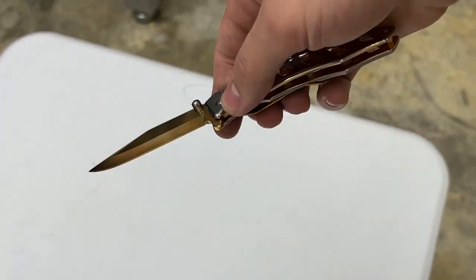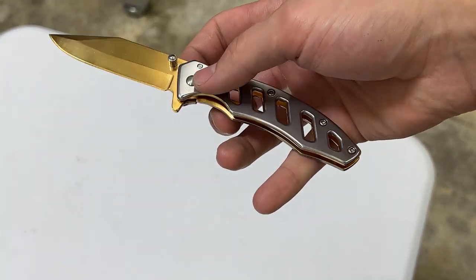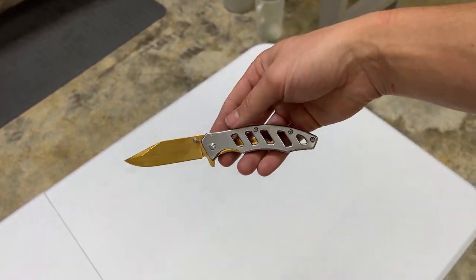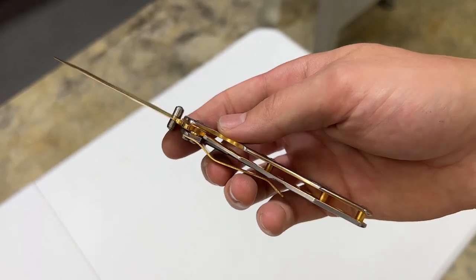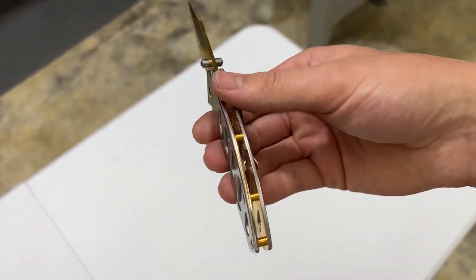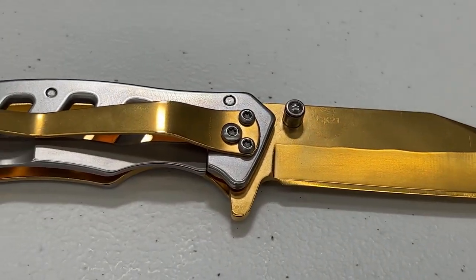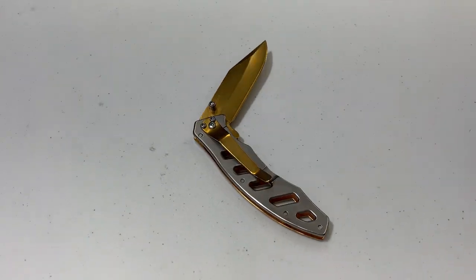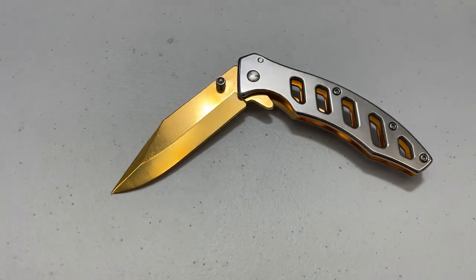As far as the masking goes, I would not recommend using it in bath plating and would recommend it for brush plating instead. The reason is that sitting in the liquid for too long caused the edges of the masking to peel up and plate on areas we didn't want. Other than that it worked really good. If you guys enjoyed this video check out our other videos on YouTube, check the links in the description for where to get these products, and leave a comment with ideas for what you want to see plated next — thanks for watching, we'll see you in the next one.